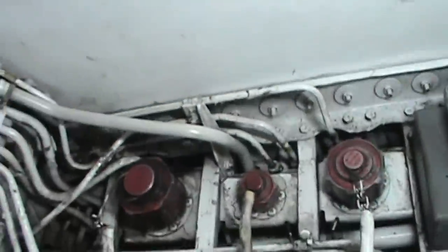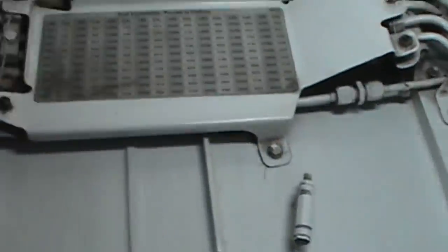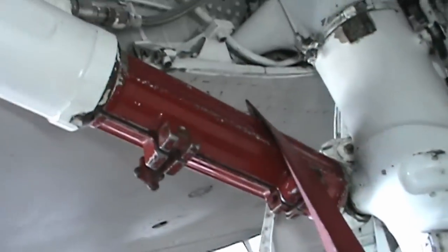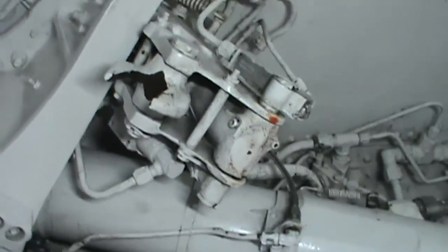The hydraulic filter there is one we pulled the other week. Here's the main landing gear assembly — some more connections, a hydraulic servicing port where we would connect the hydraulic mule. Also fuel connections and a conversion table for ground mechanics. There's the brake assembly on the hub, and that is a landing gear lock that keeps it pinned down so it doesn't retract on the ground. There are the up-locks and one of the missile rails — you can attach a bomb at the bottom or another missile.